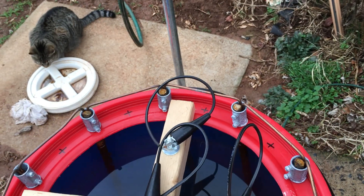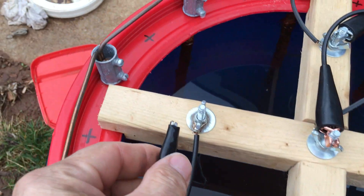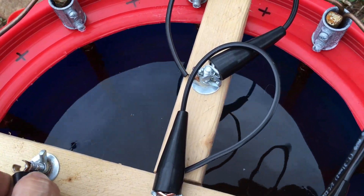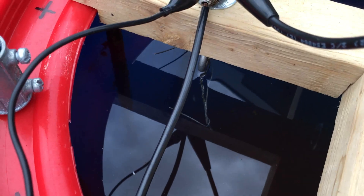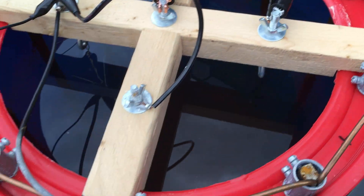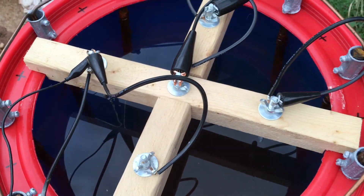I simply take the DC power supply, and I've gone to the trouble of putting little plus signs on the copper wire around the perimeter so you clip on your positive there. Then if I have something hanging, I clip the negative to it. If I need to feed additional things, I have extra wires I can connect. As a secondary measure, I'll stick a wire down into the water and clip it directly onto the object I'm de-rusting, so I know I have a solid electrical connection. I may cross-connect all the hanging points so connecting to one feeds them all.